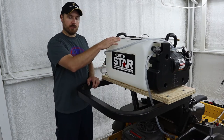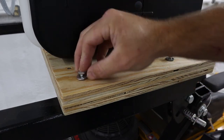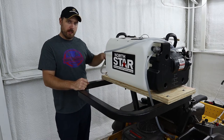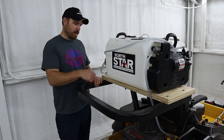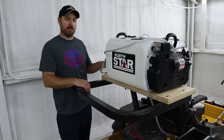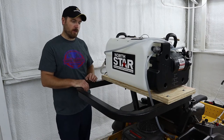That should be plenty strong enough even when I've got a full 16 gallons in here. I drilled through to put two bolts down into the rollover bar, and when I drilled into that rollover bar, I put two nut certs in there — basically a rivet tool that rivets a nut inside of that tube so that I can just screw the bolts down into that nut. I didn't want to drill all the way through the rollover bar — it's just a cleaner look having the nut on one side. So when I remove the tank — because I don't leave it on there all the time — you don't even notice those nuts are there. It keeps a much cleaner look.